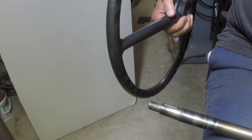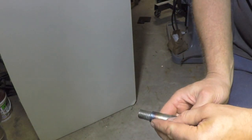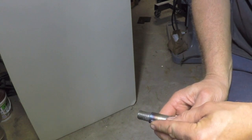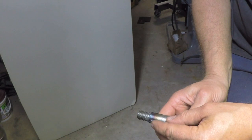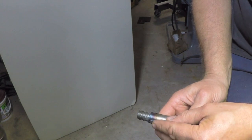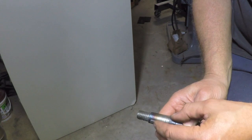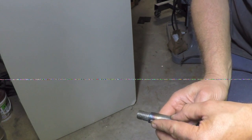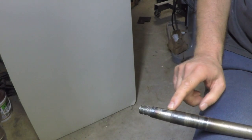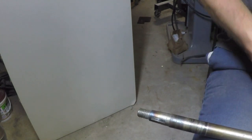Well, I wonder how much of that's sticking up. I just checked, and that chart says that this should stick up only about 93 thousandths, and right now it's sticking up about 108. It almost seems to me that I could go 15 thousandths deeper and be okay. But I don't know. See if I can get this set up in the mill easy enough. If I can, I'll make this 10 thousandths deeper.